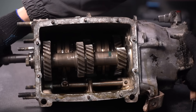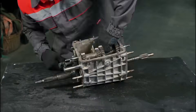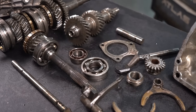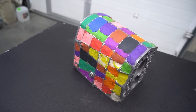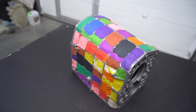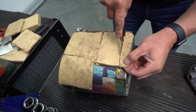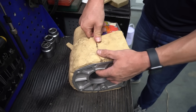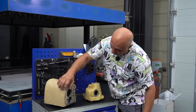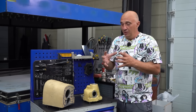We're making a fully transparent gearbox. Now, to get this whole thing right, we need to properly model it. And as you might remember, polyester resins can't handle this sort of stress. So we have covered the entire thing in clay in order to make the walls thicker. In certain areas they have become thicker by 10 millimeters, in other spots by 15 — that's to make it that much more durable.